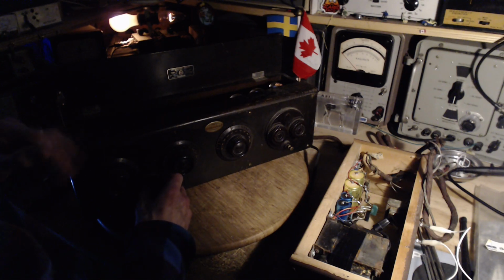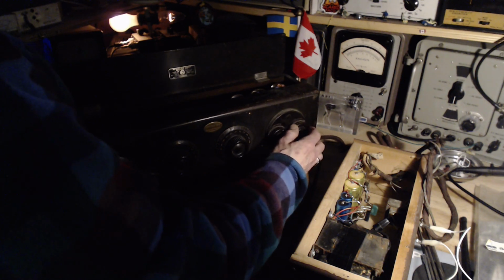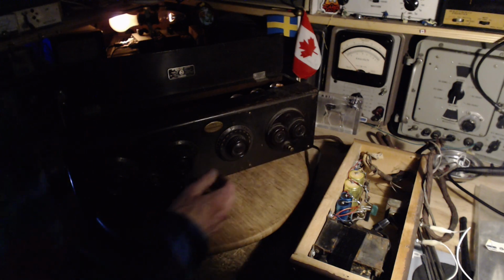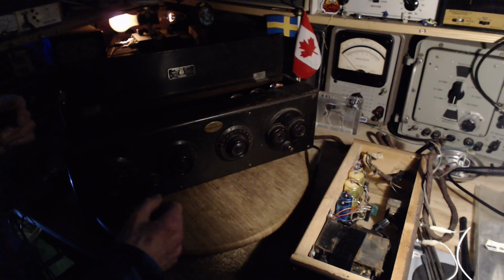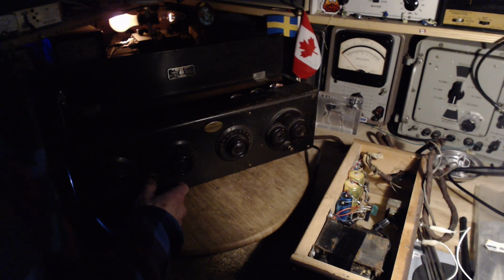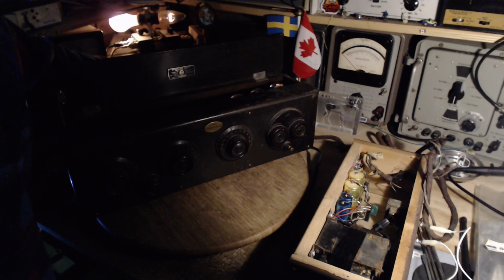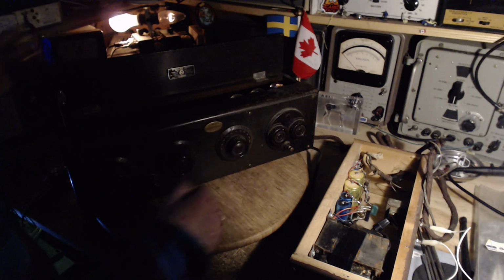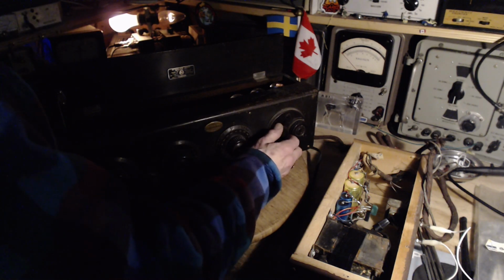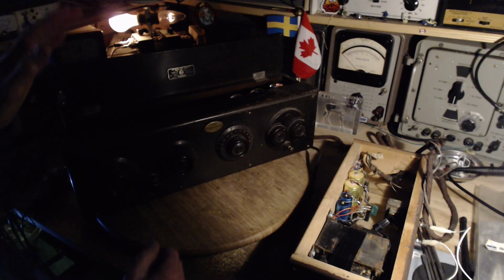I don't hear a thing. All tubes are glowing. Could it be the tuning? Wow. Where are we now for voltage on it? So we're at 105 volts. You know, that should be enough. Well, we don't know what's going on with this power supply exactly. Go a little bit higher. But now there's just a little more voltage causing a lot more current to flow. Okay, back these down, back them up. Still not a sound out of the speaker.